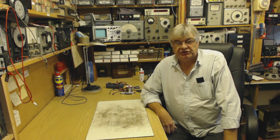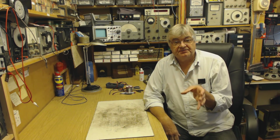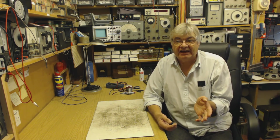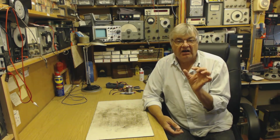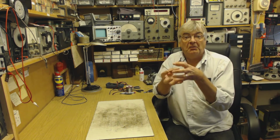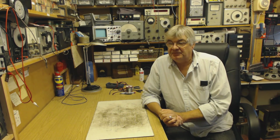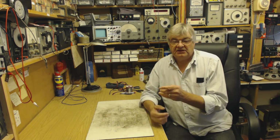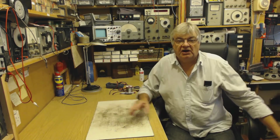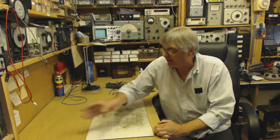Vacuum cleaners, electric drills, and in the early days even hair dryers used carbon brush motors. Carbon brushes, especially when the appliance is wearing out, arc on the commutator. I've seen sparks travelling all the way around the commutator, like a firework display when it's really bad. All that interference from the appliance, say it's a vacuum cleaner, is sent down the mains cable into all the house wiring.